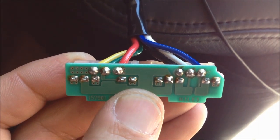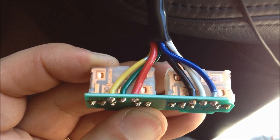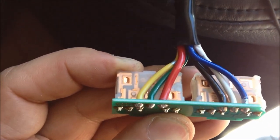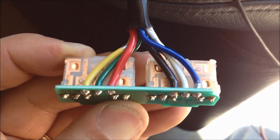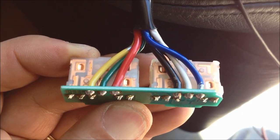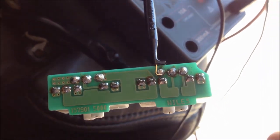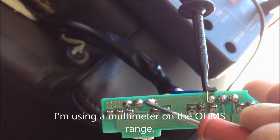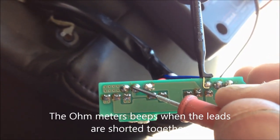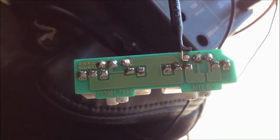Checking the switches now — there's actually a black wire and a red wire. I'm going to assume that's the plus 12V, and that means the blue and white go to one motor, the green and yellow go to another motor, and the polarity of those will get switched. I'll have to ohm this out and verify everything works. Step one for ohming out the switch will be to attach the clip lead of the multimeter to the black wire, then take the positive lead and verify that all the motor wires are grounded. That's grounded, that's grounded, that's the plus 12, that's grounded, and that's grounded — so all the switches are making contact to ground, which is what they're supposed to do.